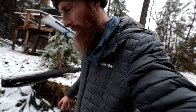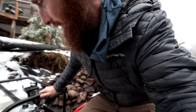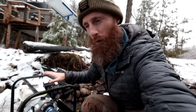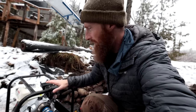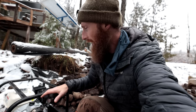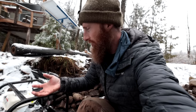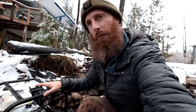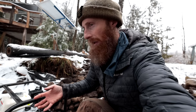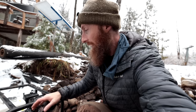So guys, when we first started pumping, we used a standard pump for clean water. This is a more robust version. This is also from Princess Auto. The other one worked good as well, but once the pond got lower and it became more silted, it started sucking up too much junk. So this is a more regular trash pump. It's a 2-inch as well. So it sucks a lot of material at the same time. It's essentially going to be sluicing the bottom here.